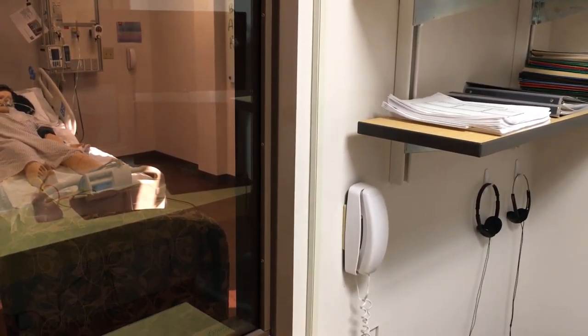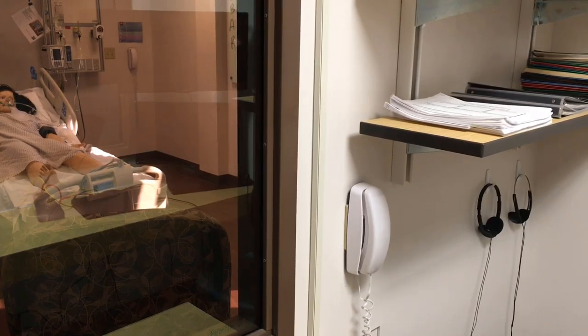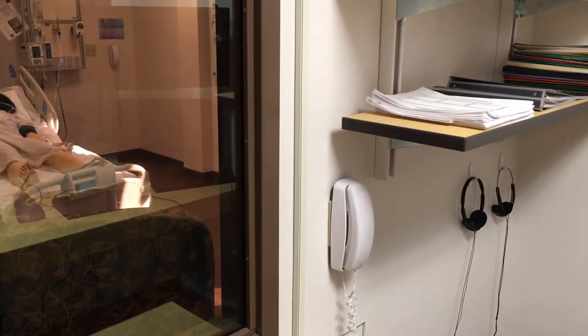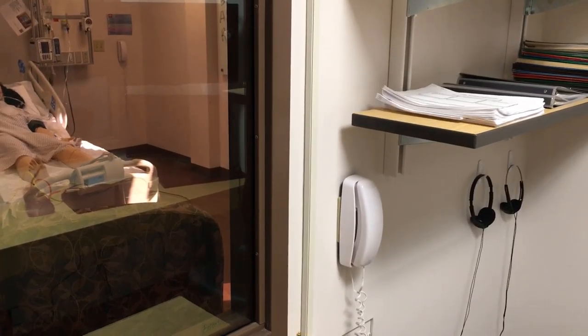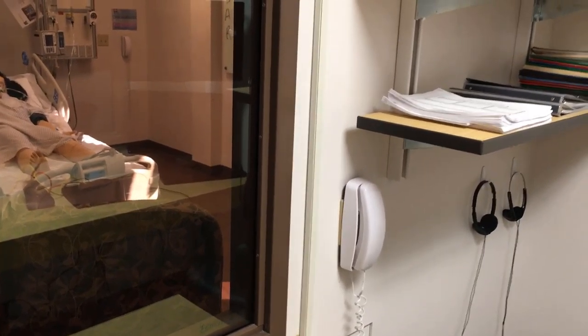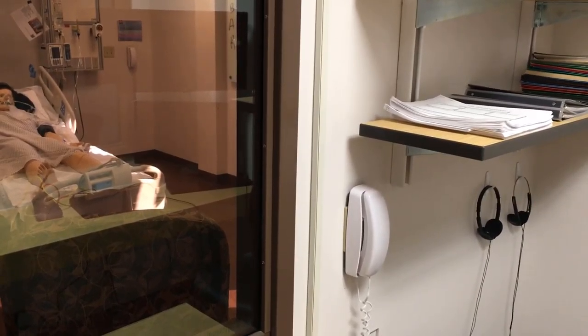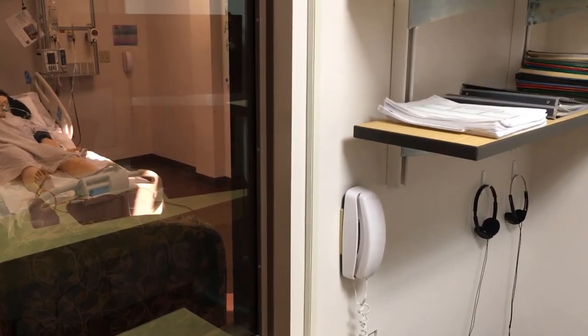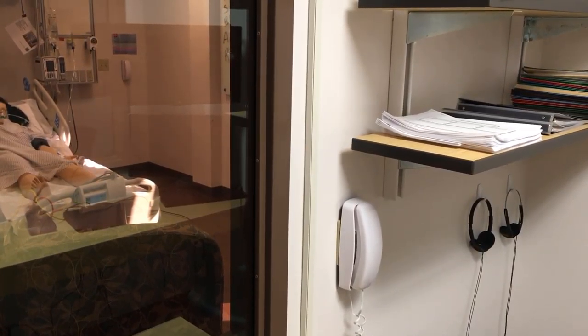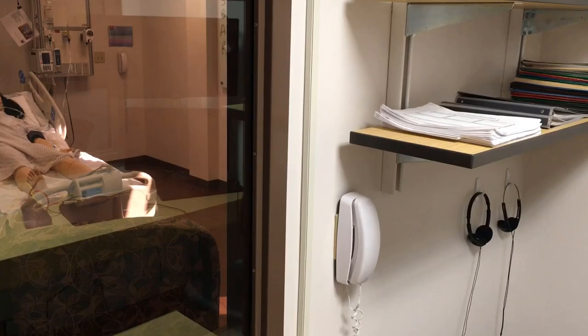The way this works, everything is just wired in and wired together. The phones are literally wired together and powered through the wall just like any other phone system. It's going to draw 40 to 60 volts from the wall, and once it picks up it's going to drop down to about 8 volts or so. We have a method of doing this with a 9-volt battery, but you won't be able to make the phones ring — though it does make the system portable.